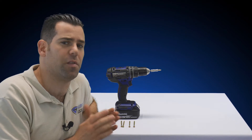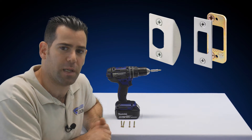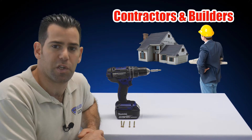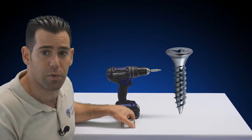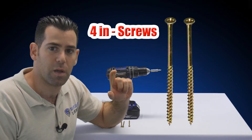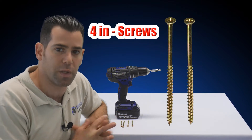The other side of the door that most people don't pay attention to is the door frame where your strike plates are — the top and the bottom strike plate. Those are actually the most vulnerable. The reason why is that most contractors when installing doors, even on old houses, use very short screws. What I like to do is always use larger screws — 4-inch construction screws to reinforce both the bottom and top strike plates.